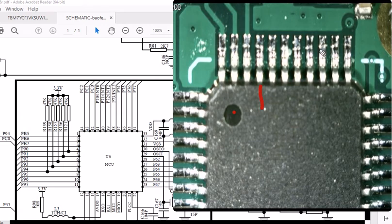I did try to, and it just kills me looking at this screen here, because this picture of the digital microscope definitely does not do it justice. It looks so much better on the 32-inch. I think I nailed it down. I switched monitors. I hooked the computer up to the 32-inch monitor. I'm trying to pinpoint why my picture looks horrible on the computer here, but looks really good on my 32-inch. Well, it's my stupid capture card. I'm losing something, so I might have to try another capture card.